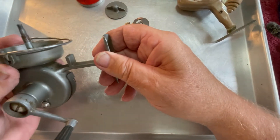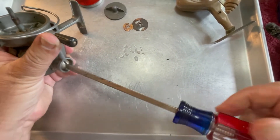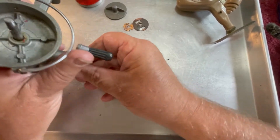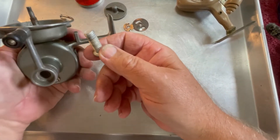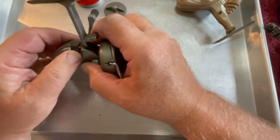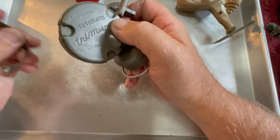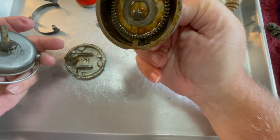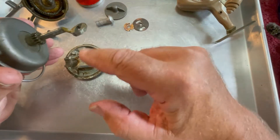We're not going to get overly zealous with this. Take this screw out to get the handle off — look at the size of that screw, it's twice the size of the axle. The body is held together by this spring clip right here, and it appears you just pop that loose all the way around so the spring clip comes off. Now the body will come apart where it can be serviced and cleaned. The axle will come out at that point — I've never seen an axle that was offset. We have an offset axle here, that's interesting.